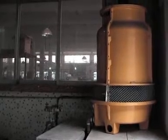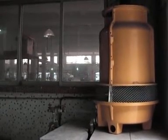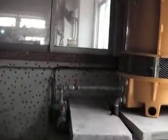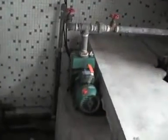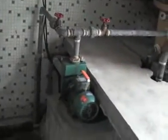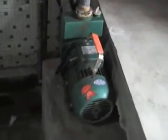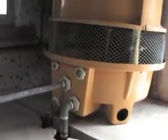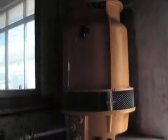On the other hand, pay attention. For water cooling units, the condenser should be connected with cooling water. The cooler the better. Water temperature should always be lower than 28 centigrade. Then use a water pipe to connect it with the water pump combined with the water tower. That means the water condenser of the popsicle machine can work.